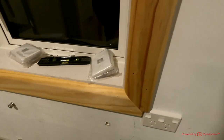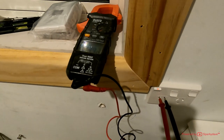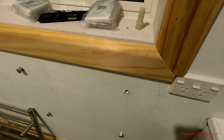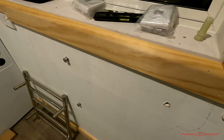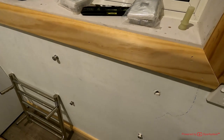Because this is recessed wiring, remove the socket from the wall — but we're live at 240 volts, so first go to the switchboard and isolate the circuit. The previous electrician has put these sockets on an RCD, which kills the circuit. Always make sure you prove, test and prove. Ensure that every single towel rail you install is off an RCD circuit — no matter what. If you're going to a towel rail on an old circuit, don't do it without putting an RCD on it.